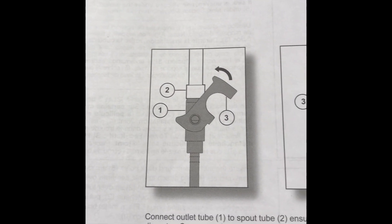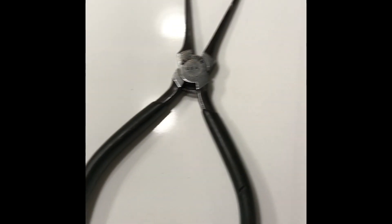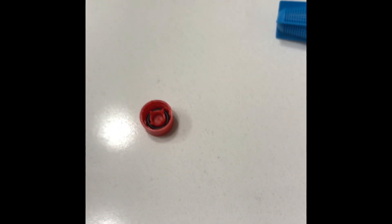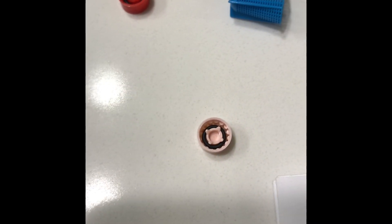On this faucet you just swing a little clip over and separate the hose, and use some long skinny needle-nose pliers to get up in the hose. First you pull the screen out, and then you grab — currently mine's a red one — grab that little square in the middle and pull it out and replace it with the pink one. Or I may try to leave it out altogether.